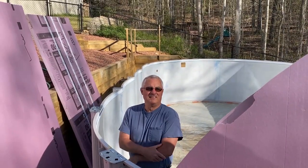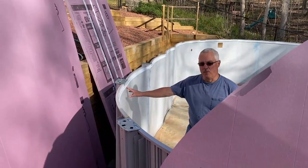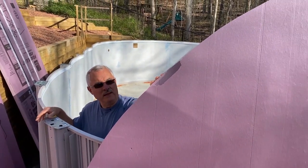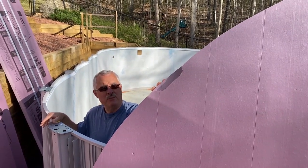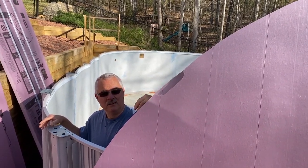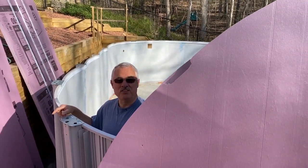All right folks, today's a big day — floor is going in. So far what we've done is we have our foam wall up — that's done. And my panels: I wanted to go with two-inch, but since I'm doing a beaded liner, the manufacturer said it has to be a three-inch floor. So it actually worked out that I was able to notch out this one-inch piece to fit over the boots inside the pool floor, and then I just glued these up. So that's what we're going to do. We'll see you after the floor is installed.